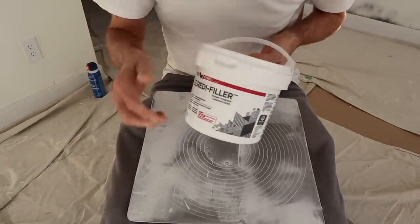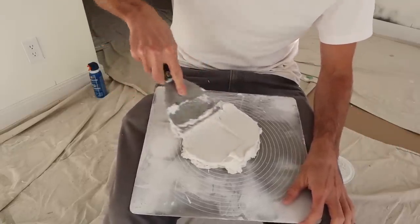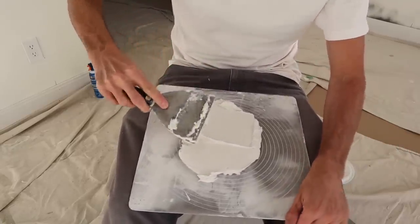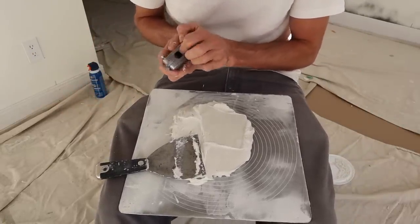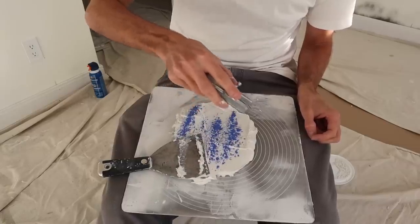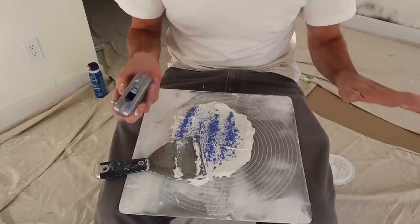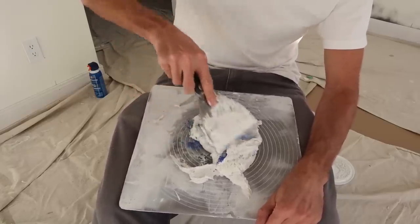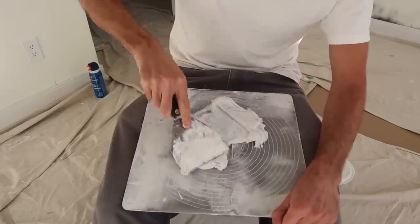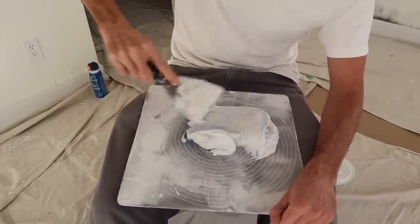Next I'm going to start filling everything. For filling I'm just using light all-purpose drywall mud — this is just your homeowner special ready filler. I really like light all-purpose mud for this because it sands really easy, it's cheap, and you can use it for lots of other things. A quick tip: you can tint your mud a little bit with blue chalk to make it easier to find on the ceiling. Blue chalk won't come through your paint, but other colors might. I also don't thin it down at all — I like it to be the full thickness it comes in.